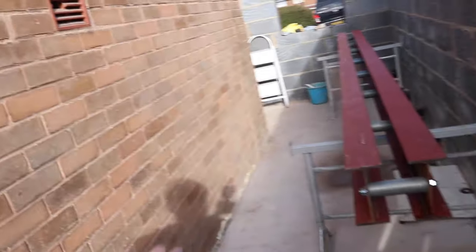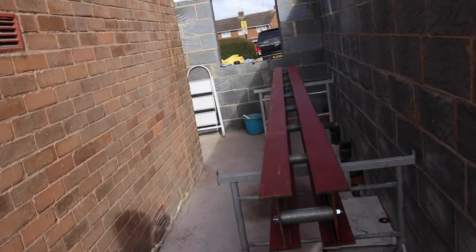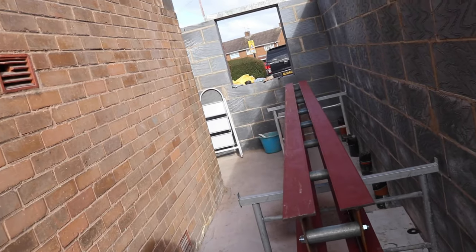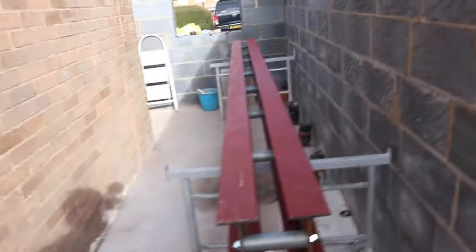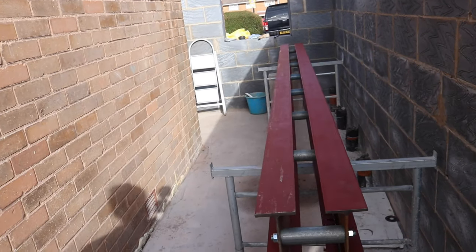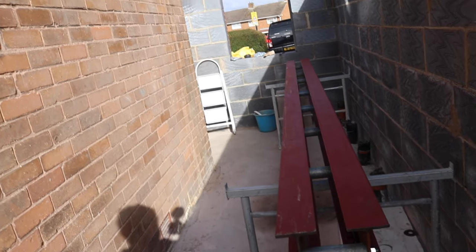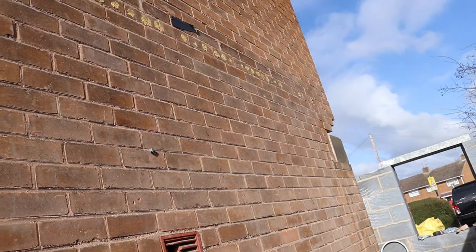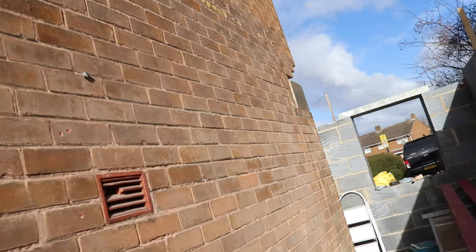Anyway, this is the steel that we've got going in above that padstone we've built. I've cut everything to the engineer's spec. We've got scaffolding pole spacers in place — as you can see, that won't move now because I've tightened it up, and it looks like a really substantial bit of metalwork. I'm going to give it probably a week to go off before we put it up there, because I want that padstone to be absolutely solid.